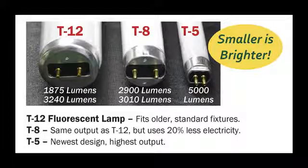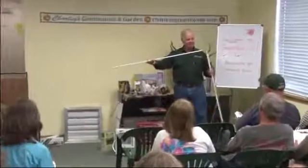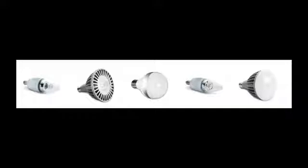This is just a four-foot version of that tube. If we plug this in, it's almost so bright you don't want to look at it. We'd like to use LED lighting because it's more efficient. The only real disadvantage of fluorescent tubes is somewhat limited life and the fact that they contain mercury, so you're not supposed to just break them up and put them in the dumpster — you're supposed to pay to dispose of them properly. That's still the problem with fluorescent, whereas LEDs last much, much longer and there's no problem with disposal.